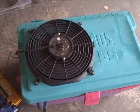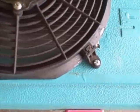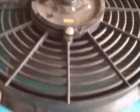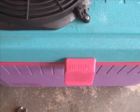Alright, here's my first trial run. Got the fan mounted — if you look close you can see the heater core inside there. I might just put a potentiometer on the fan to slow it down. You can see I have very little ice in there because all I had was in my freezer ice maker. But if you put a couple bags of ice in there it would be great. Anyway, we've got the bilge pump pumping up through one hose, into the heater core, out the other one, back into the ice water. And there's all kinds of room in there to put your drinks and everything. I think this is going to work — it sure does feel nice. I might just close the garage door and air condition the whole garage.